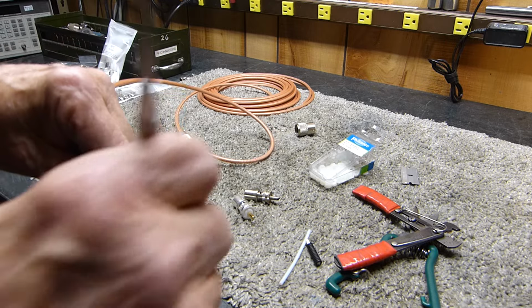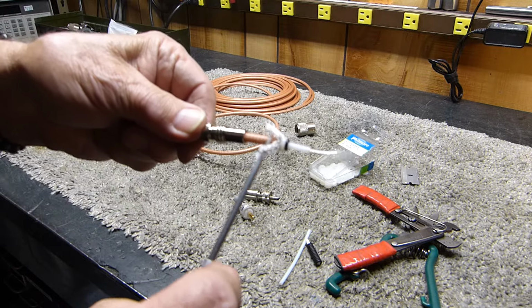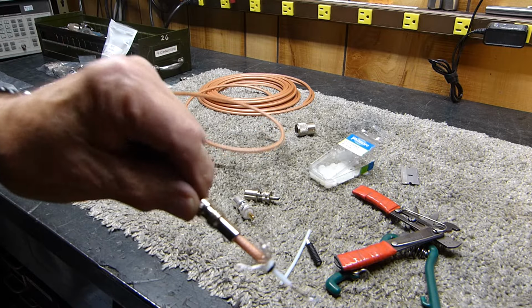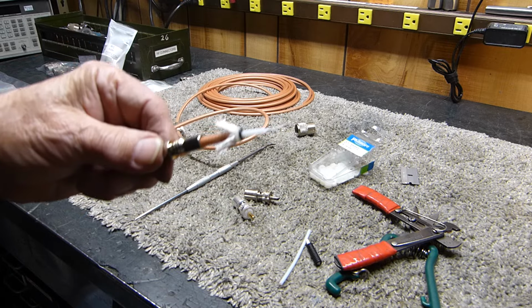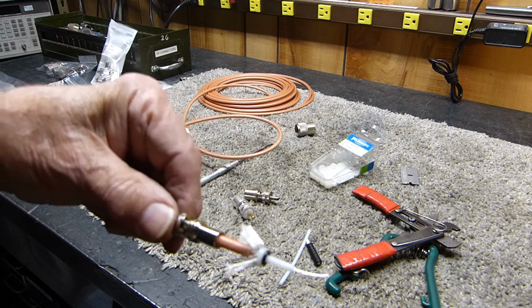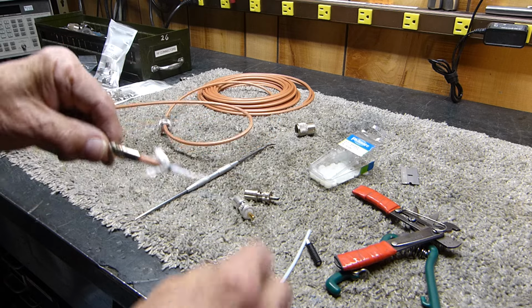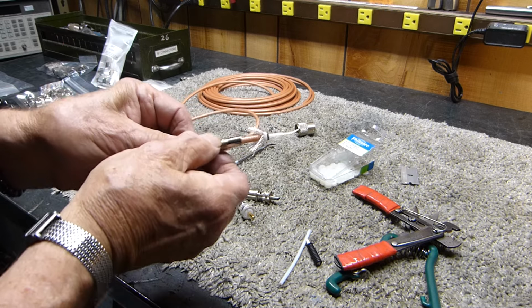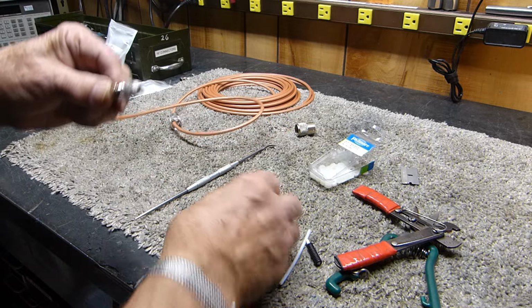Yeah, I built some of these things, and I was so confident, and I went in there and it didn't work. Brought it back out. I said, well, which end is shorted? The way I can find out which end is shorted is by measuring the capacitance with a little capacitance meter. The one that's not shorted will show you some capacitance in the wire, and the one that is shorted will be zero. Well, they were both zero. I said, I'm not that unlucky, am I?